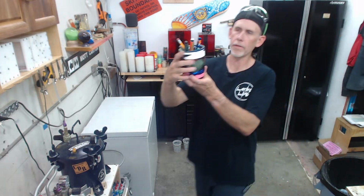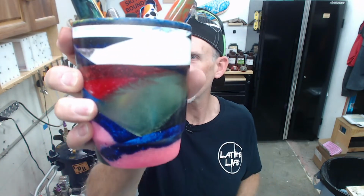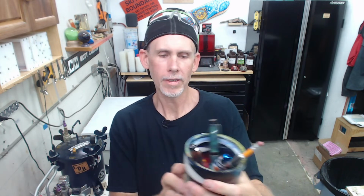I turned one on a live stream not too long ago. We're not pressurizing this, so just be warned. There's going to be bubbles if you have transparent areas, but as much as we try not to, we pressurize these things and we want to get rid of bubbles, it's actually cool looking. So as long as you're not messed up about it, it's kind of an interesting little addition, and it turned fine. I had no problems with the one I made, and it's a simple turning. If you want to get into hollowing, I think that just doing a jar or a cup like this is a really great project to start out with, because you can pretty much hollow most of it using just a Forstner bit.